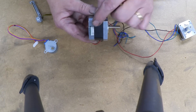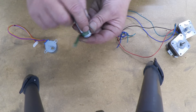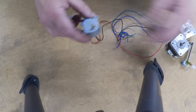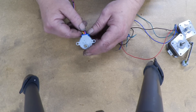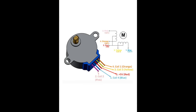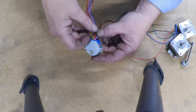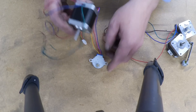Sometimes the motor has a pin connection — you'll need connecting wire and do exactly the same resistance test. Some motors have five wires, which can be confusing, but you can find the pinout diagram easily by searching the motor name plus 'pinout.' The two end coils correspond to two of the wires, and the red wire taps off the center of each coil. Simply ignore the red wire and attach to the other two pairs — it works exactly the same.